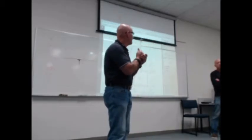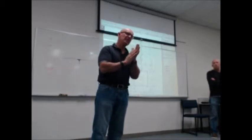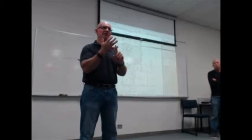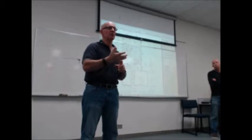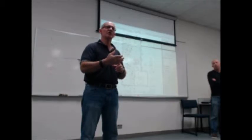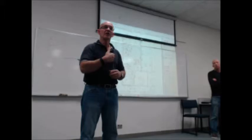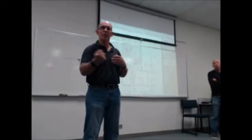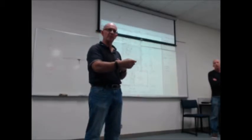Waterproofing came in, in its basic terms, in about the 80s, 90s. It used to be a galvanized angle in the internal corner and silicone. Then when they brought in WR board, believe it or not, you used to seal the edges with a green duct tape. I've actually seen that in a building, yeah. So wherever you had a cut, or an internal corner, or the bottom, you put this duct tape on. It didn't stick to a cut edge of plasterboard, but it stuck to the paper, right?